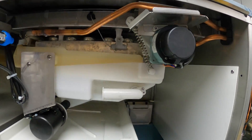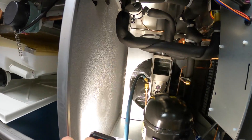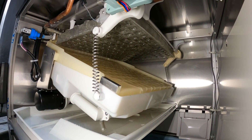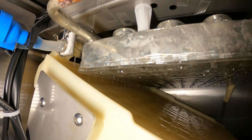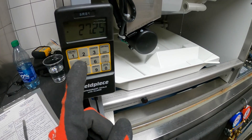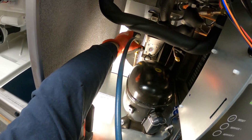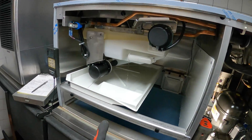It's 1:53 — it's been 21 minutes. Condenser fan just stopped. Compressor is on — this pipe is nice and hot now. It's probably gonna drop some ice right now. We got ice there — come on, show me the money. Let's see if it drops. It's slowly starting to melt. I see a little bit — it's coming down. There's the money. We need 26.5 ounces, but I got right now 27.25 ounces, just because when you take off this hose you lose a quick little amount. So we're just about there. Gauges are off the system — we're gonna let this run.